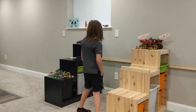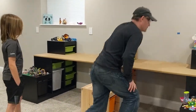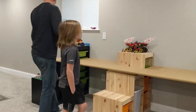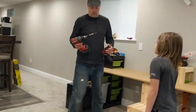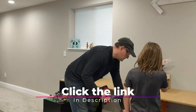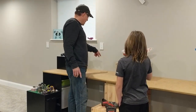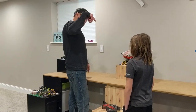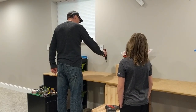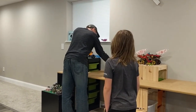Now we're in the exciting spot — we can test it for fit. This is pretty good, pretty sturdy. Just to prevent it from shifting, we're going to put one fastener here and one fastener here. Instead of a normal drill bit, we're going to use a countersink bit — when we use this, it allows the head of the screw to sit flush so it doesn't stick up. We also need a way to drive the screw in without hitting the wall. The drill has a certain distance from the chuck to the center line, so you can't make a hole all the way against the wall. However, we've got an offset driver — we can put our screw straight in even though it's very close to the wall.